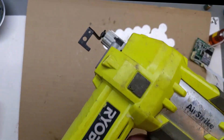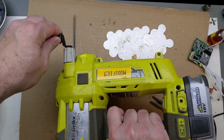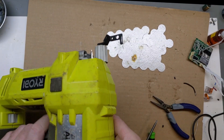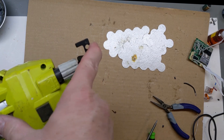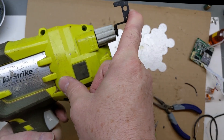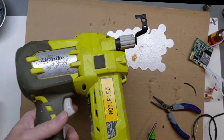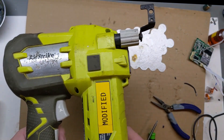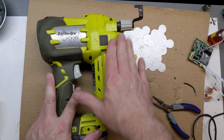A quick and safe test here - being careful to keep everything out of the way. We pull the trigger, we get our light. LED's working good. And it doesn't go off until we make the safety. Make the safety - it doesn't go off until the trigger's also made. So it's an AND operation. Both this switch does nothing alone, this switch does nothing alone - but if you have to modify one to get by, even though I don't recommend it, that's going to be the way to do it when the control board's gone.